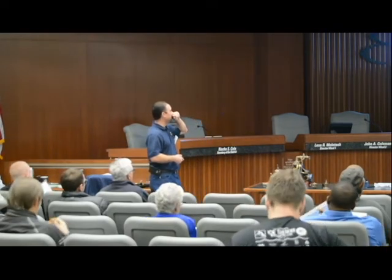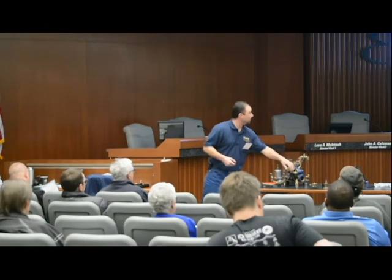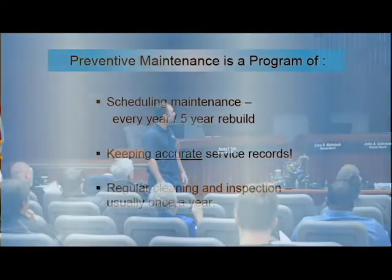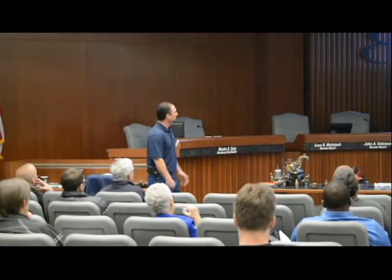For preventive maintenance programs — these do not need to be rebuilt every year. They will last five years, even longer. If you can get on a program where you're replacing all internal parts every five years, cleaning the disc once a year, and keeping accurate records, you're doing well. We're trying to get there — we have a lot of the system in a lot of different places and some get passed over. Get the records accurate, get them rebuilt every five years, and try to at least open them up and pump the water out every year.